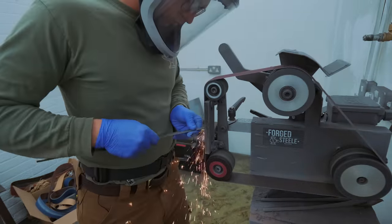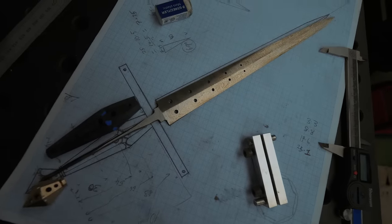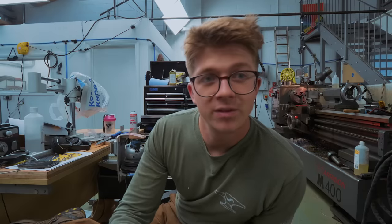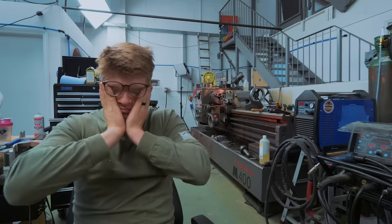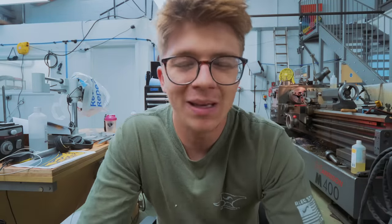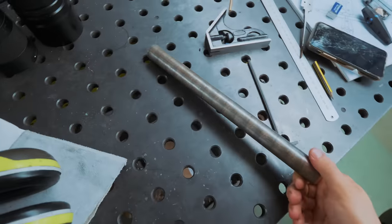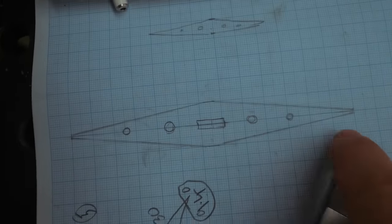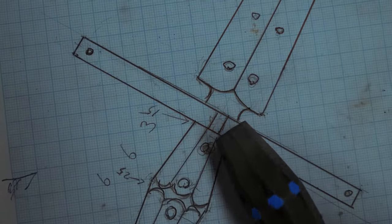Let's make some progress and grind in the tip. Hot off the grinder at an A65 Trizact finish, we've ground our bevels. So we're about 30 hours into this whole thing, it's 6pm. I've been able to have a look on Instagram and see the progress others are making - Niels is just cruising on ahead. I haven't even started on our final component - the guard. Everything else is roughed in, so if we had to make a sudden quick dash to the finish line we'd manage, but without a guard that's not going to happen. I'm going to take this bit of bronze - we'll be making the guard rectangular on one side, but on the other elevation it will have tapers, continuing our whole faceted octagonal motif in both axes.